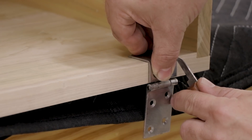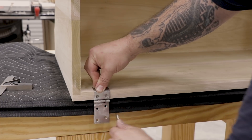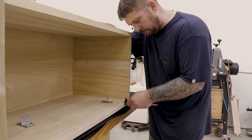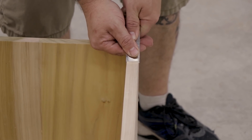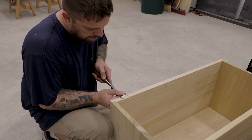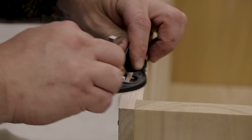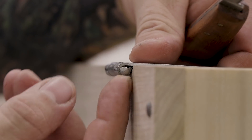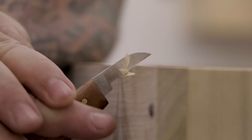I'll use my combination square to measure in from each side to figure out where I want to place the hinges. Then I'll come back with my marking knife and trace the hinges in the top of the backboard, and use the marking knife again to deepen the scribe lines. I'll scribe a line for the depth of the mortises with the marking gauge, then use a wide chisel to start removing waste up to the scribe lines. That'll create a little dome in the middle, which I can then pare away with my chisel. I'll stay just above the line and then use my small router plane to take the rest of the material off and clean the bottom of the mortise out. When I test fitted the hinges, I realized the barrel was hitting the back of the case, so I took my marking knife and removed a little bit of material so everything would sit flush.